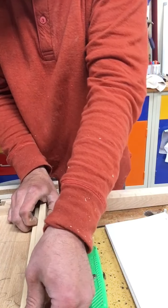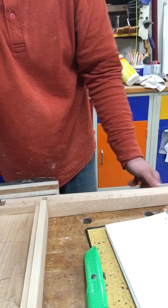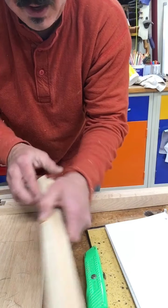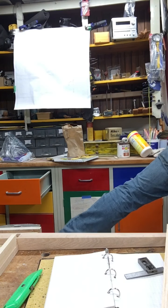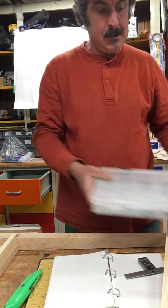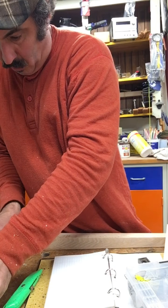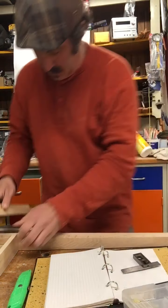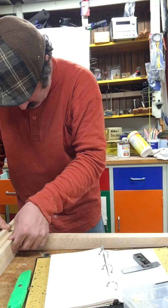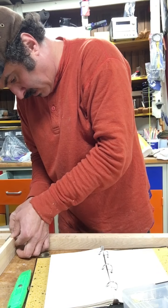In terms of putting this on, I've got a lot of options. Number one, I can just go ahead and glue it on because it's going to be a face glue — it would be a very strong glue joint. I can use screws, but very honestly I prefer not using screws whatsoever. When you put glue on the end and set it on top and clamp it, so often you get the piece moving around on you. So I want to show you a tip to prevent that. I can use this up to that edge there and bring it up to line it up perfectly — flush with that — and make sure it sits and touches, which will keep it all at the right spot.